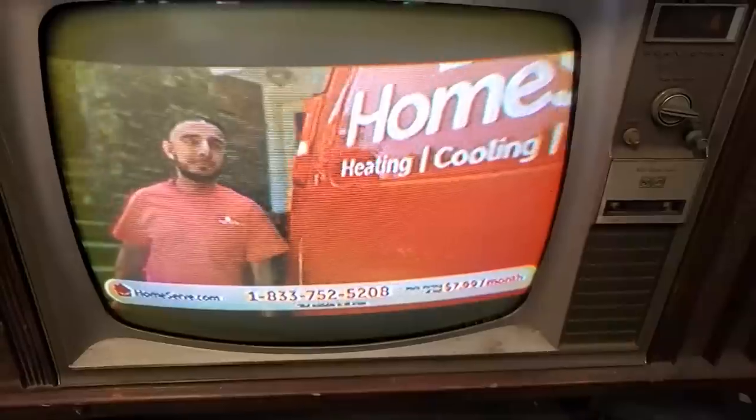Well, I'm trying to get this. You can see it's neat. It gets real small at the bottom, so trying to get the vertical linearity adjusted without a generator is pretty difficult. I got it pretty good.